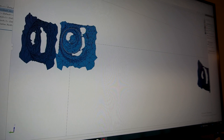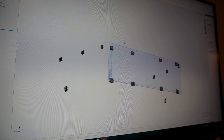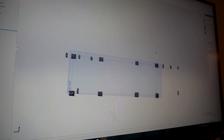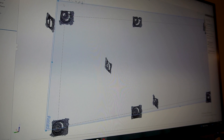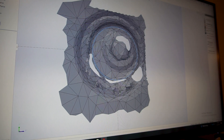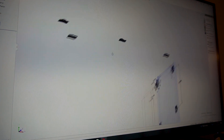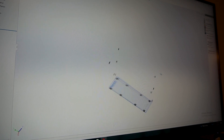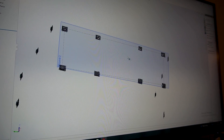I've done a bit of legwork. The 3D scan creates more or less imperfect dimensions, so it's a matter of going through and making judgment calls to create what I believe are accurate dimensions — nice 90-degree angles, straight square dimensions. That's the setup I'm working with, and now I'm going to rough out those panels.